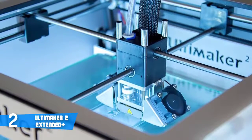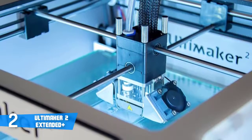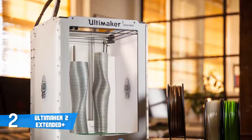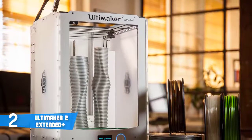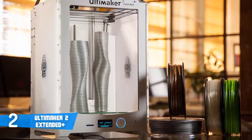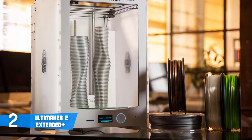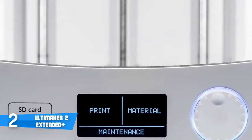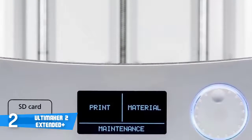First out of the box, assembling the printer doesn't take that long. What you do is place the glass plate into the metal fixtures on the floor of the printer, where it's held in place by 2 metal clamps in front. On the back of the printer is an opening into which you snap in the filament spool holder, while you need a little arm power for that. To continue, on the side of the printer you'll see another opening, and this is where the filament guide is mounted.